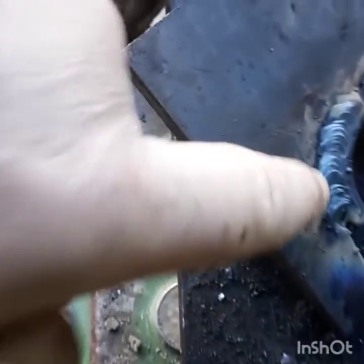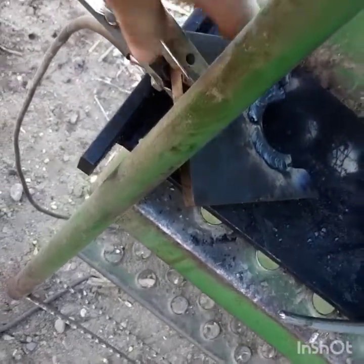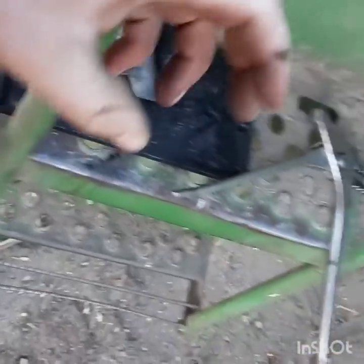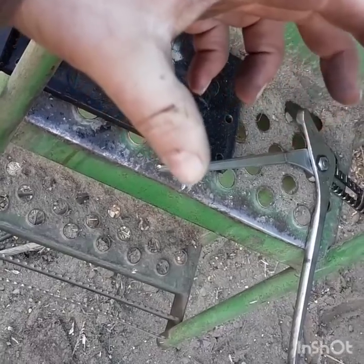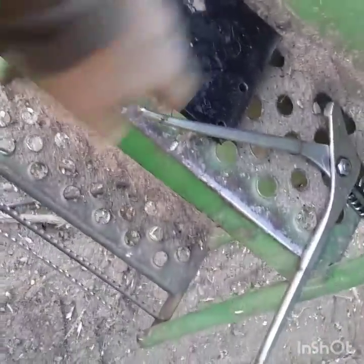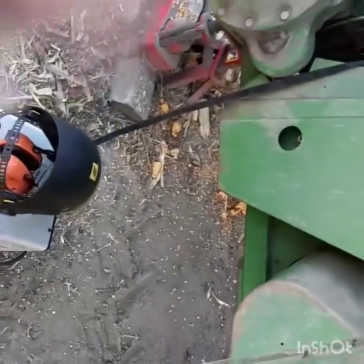I've got it welded in there — boy, that don't look too bad for kind of hodgepodge work. I used some heavy iron here as a base to weld to. This will be the back side; on multiple beads you do your welding on the outside. If you ever want to remove a bearing or a bushing from a housing that's stuck, you lay a bead on the inside and it will suck that part in and then you can just remove it. I'll cool it off and we'll test fit it.